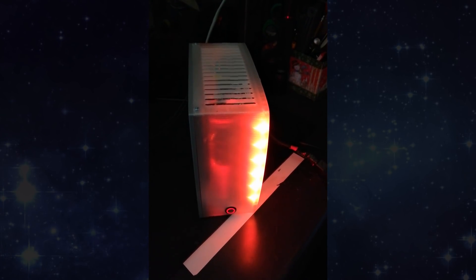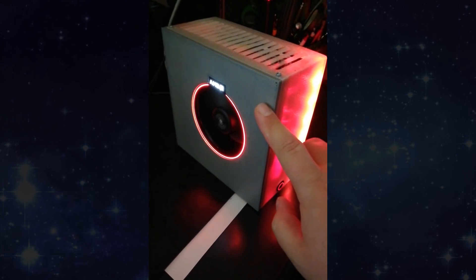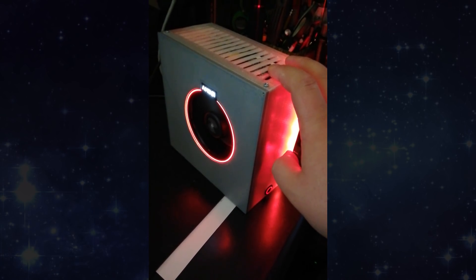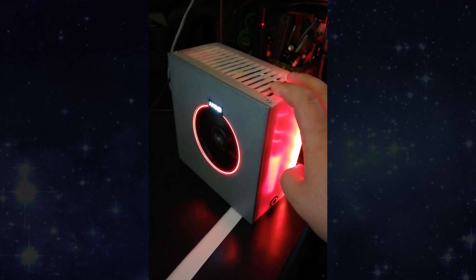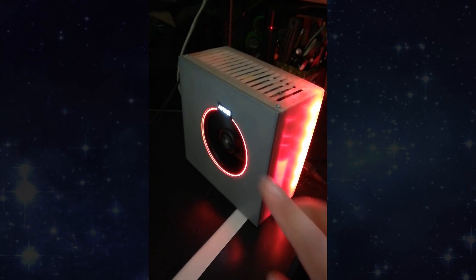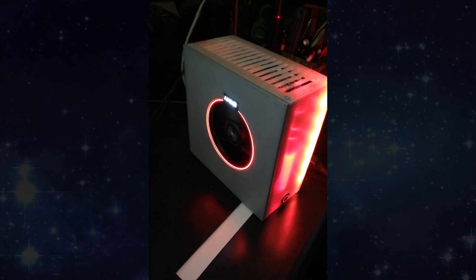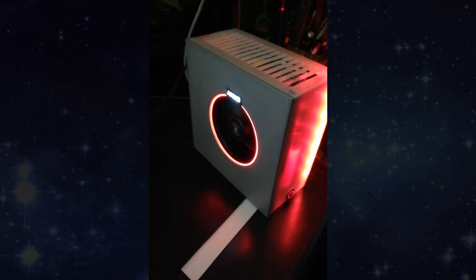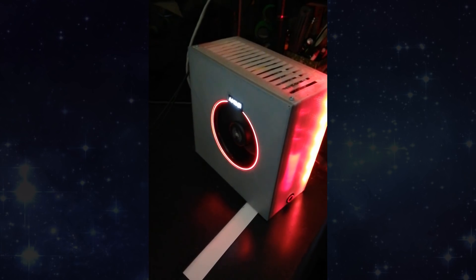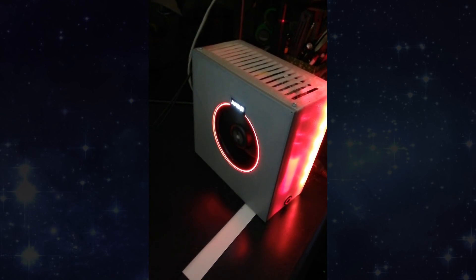The top is not PETG — the top is PLA, which is your more traditional filament. I ran out of clear PETG printing this; it was about 30 meters worth. So this part is silver PLA, which comes out looking gray. It's a little bit more brittle. I printed it at the same layer height with the same nozzle but had to slow it down a little bit — PLA is a little more stringy and gooey, so you've got to slow it down.